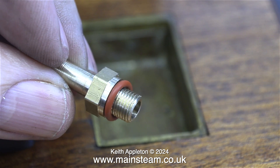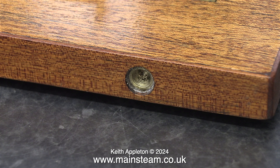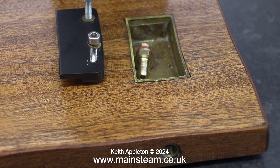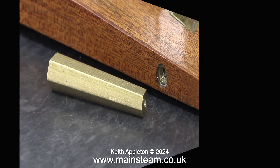On the steam plant there is a small drainage sump. This in turn needs to be drained into a receptacle somewhere on the floor. This image explains it clearly — there is a pipe that goes from the outside edge of the board into the sump, and this part that I'm making allows the fitting of a piece of silicone rubber pipe.